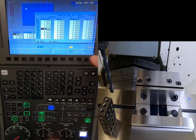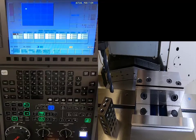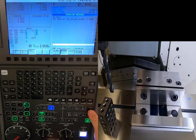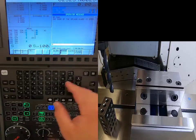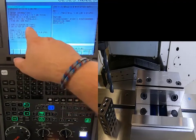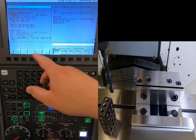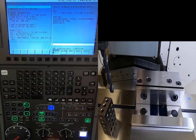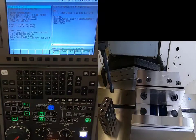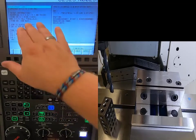Now we're going to set our work offsets. I'll hit End, go back to the main screen via Quick NC, and then return to it because we need to call up our edge finder, which is in location number ten. We're coming back to our setup information screen to confirm where the work offset is — X and Y locations. Remember your right-hand rule of thumb: X is plus, Y is plus, Z is plus.